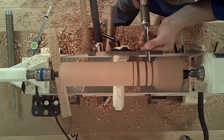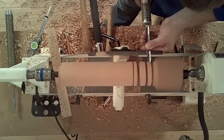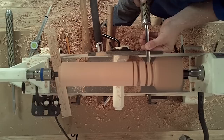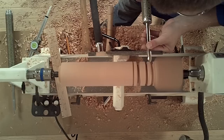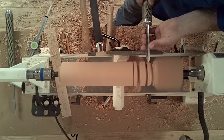To produce the bead, I'll start at the top of the bead with the flute of the spindle detail gouge flat, then I will roll while raising the handle to create a curve. Each successive cut gets closer to my pencil line — rolling and raising which just removes the corner. Same thing on the opposite side, but rolling in the opposite direction.